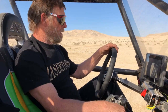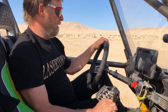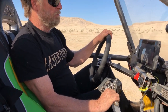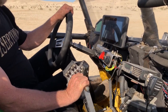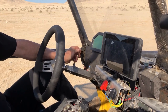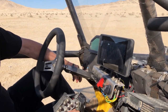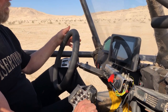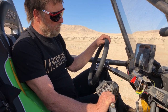Okay, I put brakes on this car, which in reality with a hydrostat you shouldn't ever need, and you really don't unless something breaks, hence the brakes. It's vacuum assist brakes, pretty standard. I've also got just manual locks, that's my parking brake, which is just valves on each line so I can lock the front or rear independently of each other, plus a little bit of redundancy when I am parked with both of them locked. So that's how the braking system of the car works.